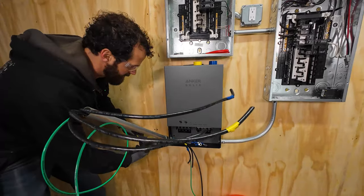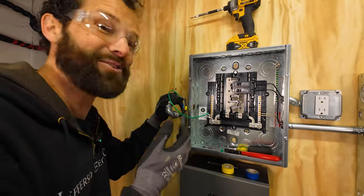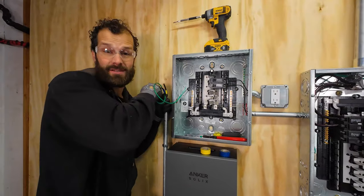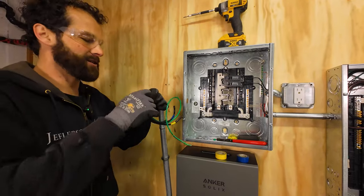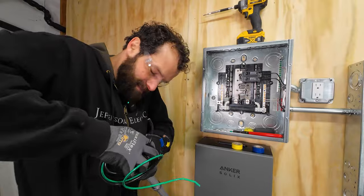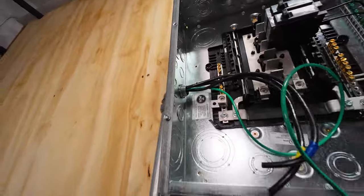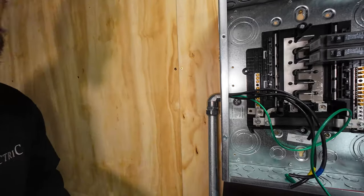Let's get up on the other side — tool tight. It's brutal when your video guy won't shut off the camera and has to catch all the crap that happens behind the scenes. LB is what you're looking for — you might use an LL or an LR, but LB is what you're looking for. Upsizing your conduit just a little bit will also provide forgiveness because there's more conductor space. Try to avoid damage to the conductors — nice wrench-tight feel.